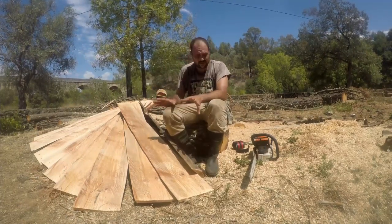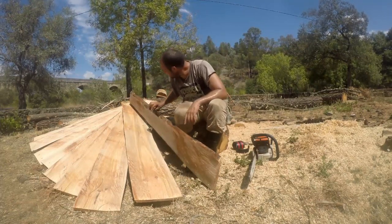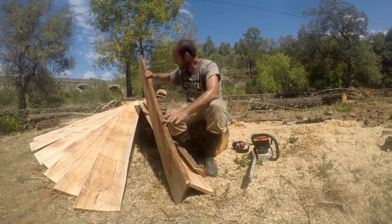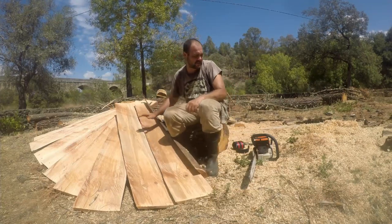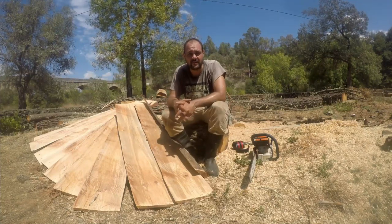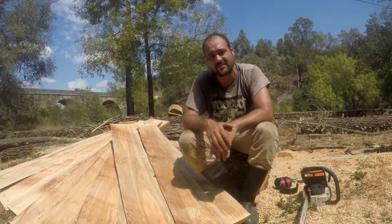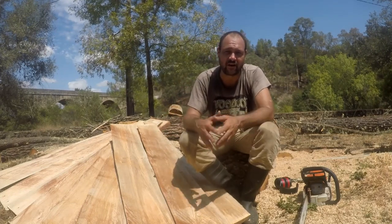Like I said, I'm still an amateur, especially using a new chainsaw and changing my technique a bit — but look at that, it's absolutely awesome. It could have been milled on a mill saw. It took me about — I timed it — 25 plus 18, so 43 minutes to do this one log, which is just about a tank of fuel. Make sure you wait for your chainsaw to cool between tanks — wait at least 15 minutes before you refuel. It is dangerous to refuel when it's really hot; you can cause a fire and hurt yourself.